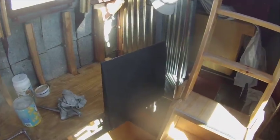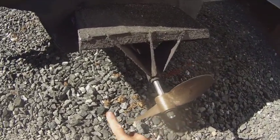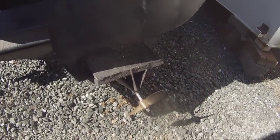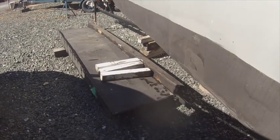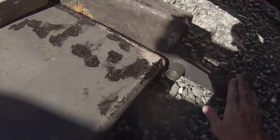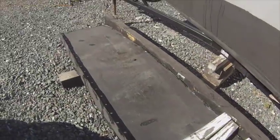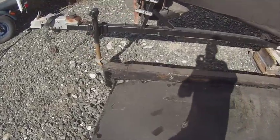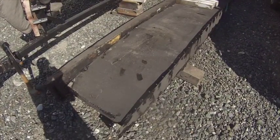And that's it — I haven't even installed the rudder yet. The propeller is on, but I have not made the protection for it yet. I'm going to get a tube, cut it to size, and weld it on. And then here's the keel, still waiting to be put on. But I've got the rudder attachment bolted on — this piece is bolted on to this piece. Everything's ready to go, and I'm just going to use the yard's crane to lift the boat and their forklift to move this around.